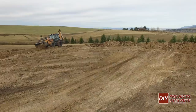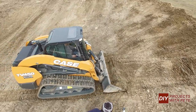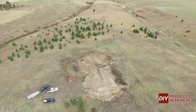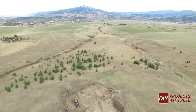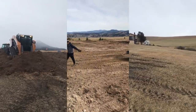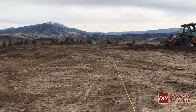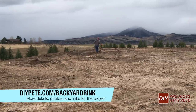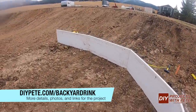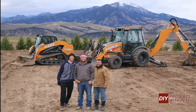Now the majority of backyard rinks won't even need dirt work done if the slope from one end to the other is under around 12 inches in difference. The only reason mine requires so much work is because my property is in the foothills of the Rocky Mountains and the flattest area had an eight foot difference from one end to the other over 120 feet. We feathered out the dirt around the ends to blend into the landscaping and got the platform level to plus or minus one to three inches across the entire area. We got it all completed before the weather rolled in, and next spring we'll run a Harley rake across the area to flatten it out even more and then plant grass. We did a quick test to see how the boards would sit around the corners, things were looking pretty good, and we headed out to our hockey league game.